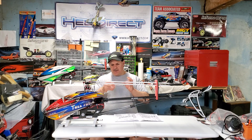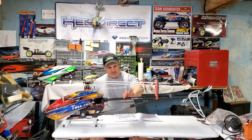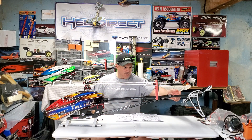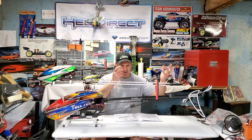It had come loose — simple fix. I took it out, cleaned the rod down with alcohol, and redid the other one just in case. I put some lube on the rubber bearing holder and slid it back in. I put enough oil so that the rubber cover on the bearing wouldn't pull off when pushing it in. Visually I could see it was seated. Ideally you should have the boom disconnected so you can confirm it's in both ends, but I'm pretty confident it is.